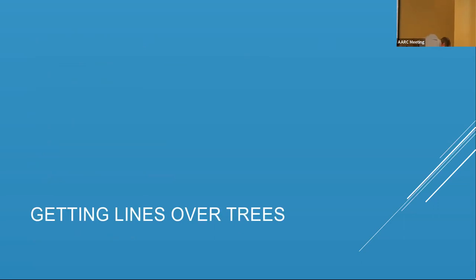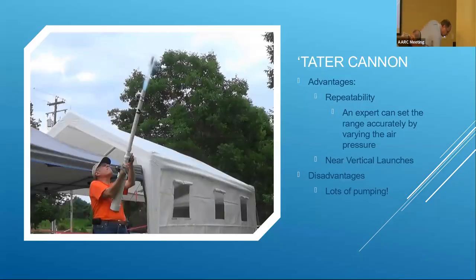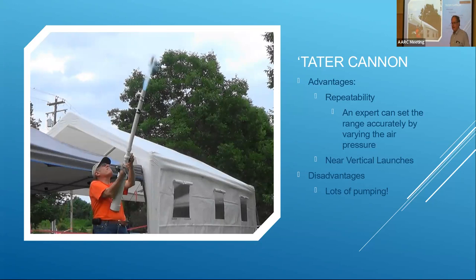The goal is to have your antenna as high as possible. And preferably, if your tree geometry is correct, you'd like the broadside to be northeast-by-southwest, because we have good propagation into Europe as well as the southwestern part of the U.S.